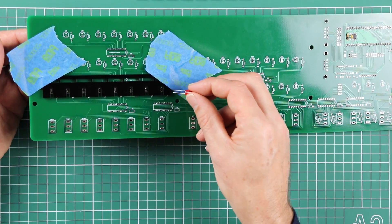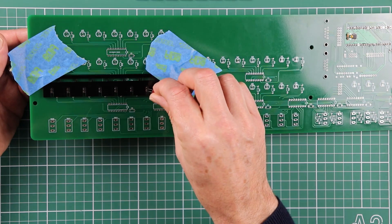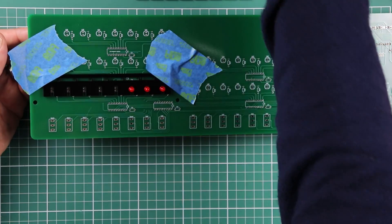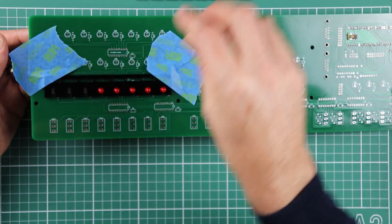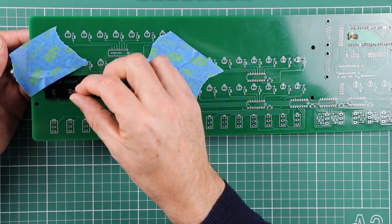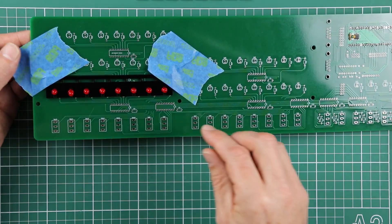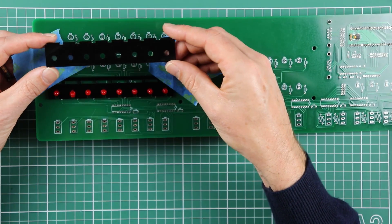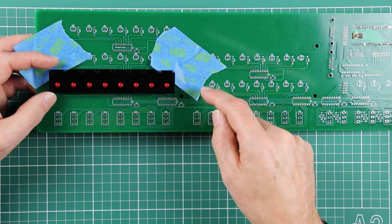Holding the PCB up a little so there's room for the legs to go through, it's a simple job of inserting eight LEDs with the correct orientation — short leg towards the bottom, long leg towards the top. You can see they just come to rest on top of that black piece of acrylic. Now for the next piece of acrylic: this one has the eight evenly spaced five-millimeter holes and it should fit down snugly on top of the eight LEDs to get them perfectly aligned horizontally.